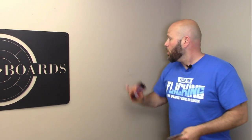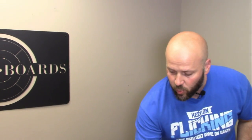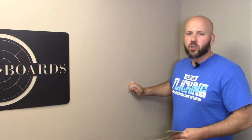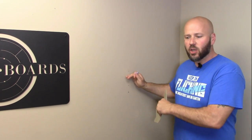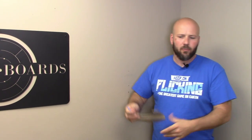The other consideration is that in a perfect world, where you want your board would line up with a stud. So you can get yourself a stud finder and see if you can find a stud. If not, that is why we have included these two plastic inserts, so you can pre-drill holes. The instructions on the plastic insert box say to use a 5/16 drill bit to drill those pilot holes. Then these plastic inserts can go in. I'm gonna do that and then come back to show you how this actually gets mounted on the wall. But from there, it's pretty straightforward.